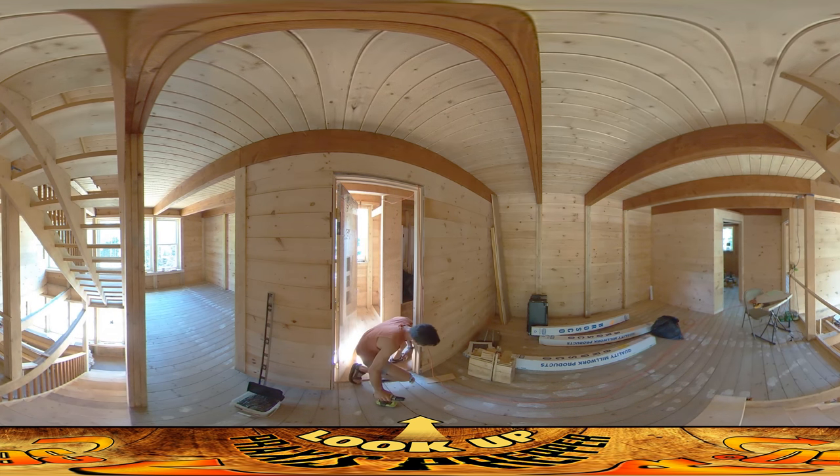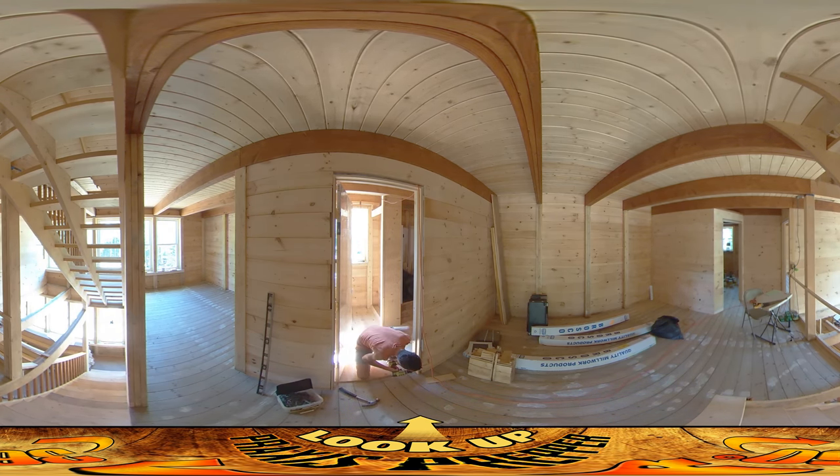Because these little spacers are so small, I like to pre-drill instead of just putting nails through — that way it helps to prevent splitting in the spacer. So I'm going to put one nail right through there. I'm not going to set that yet though, because I want to test this out first. I'll put one more nail in here. Now you don't have to put one on the middle one and usually people don't, but these things always drift off — they're just held in with a couple of little staples and I'm always pushing them back because they drift. So I like to just lock them down with a nail.